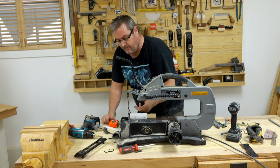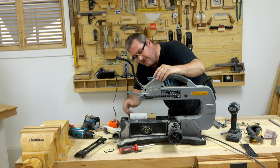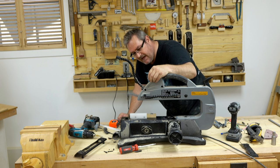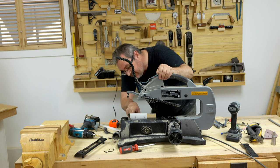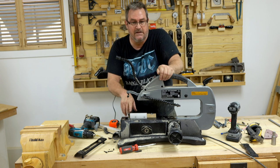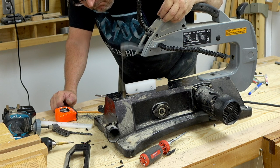I've got it put on and I think I have it adjusted correctly — it's definitely putting force on the back of the blade holder. Turning it on, it looks good: it's traveling straight up and down like I wanted. Increasing the speed, it's developing a little bit of a sound. I think what's happening is when I cut that 45-degree notch on the bottom, I didn't leave enough space and the arm is coming up and slapping it. I'll take this off and cut a little bit more off and see if that works better.